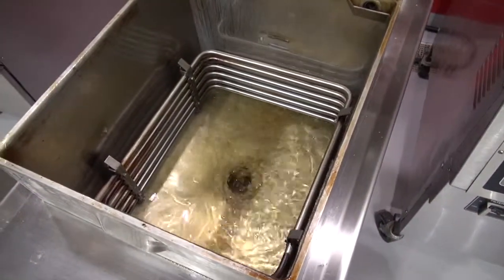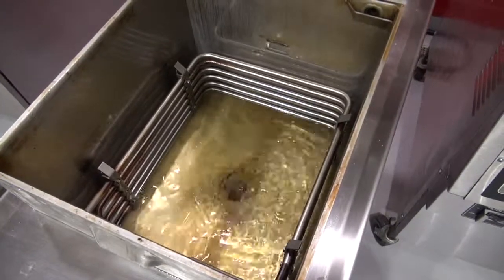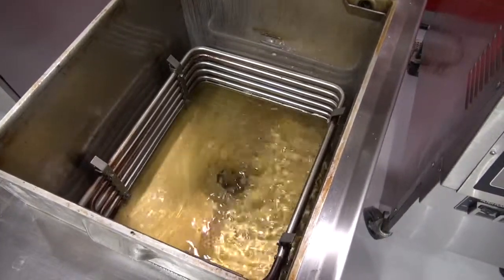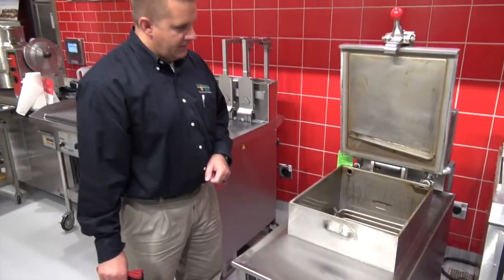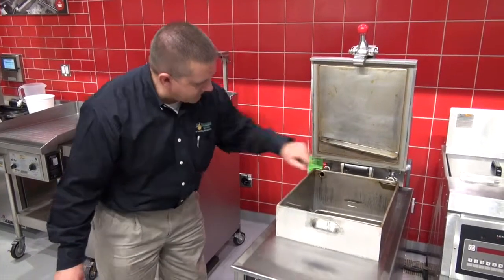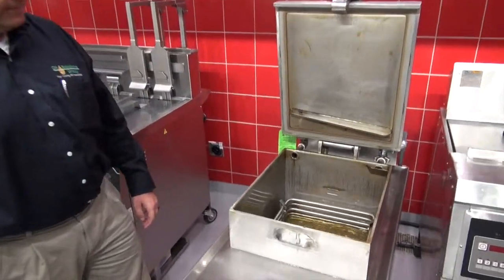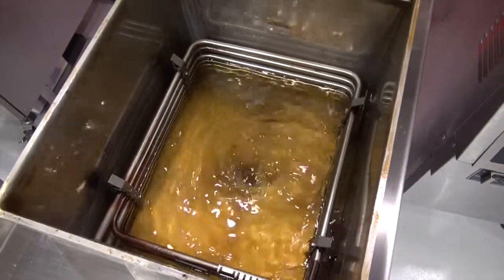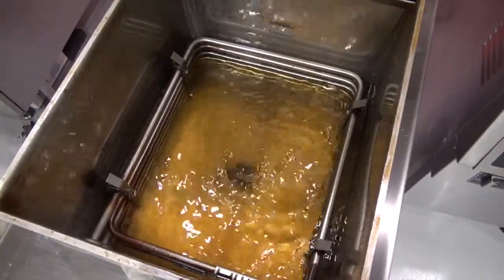That has been filtered through the master fill filter, half micron. And you'll notice the pump is humming very nicely. There's no strain, no stress on the pump. It's pumping up pretty quickly, and we'll want to make sure that the oil goes back between these two oil lines here. Nice job so far, dude. Looking really good. As the oil comes up, we're going to let the oil run for just a few more minutes, just to make sure we suck all the oil out of the filter.